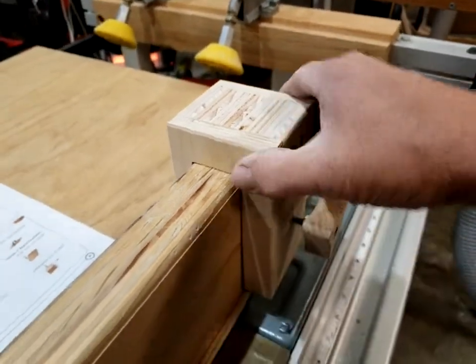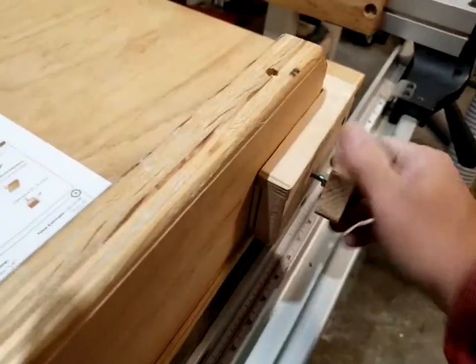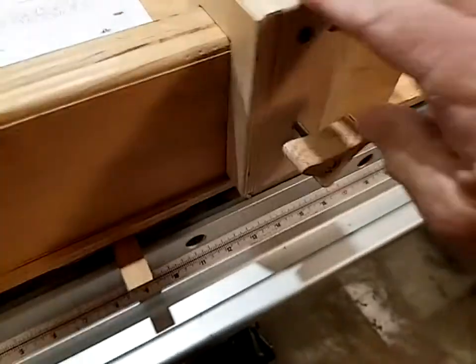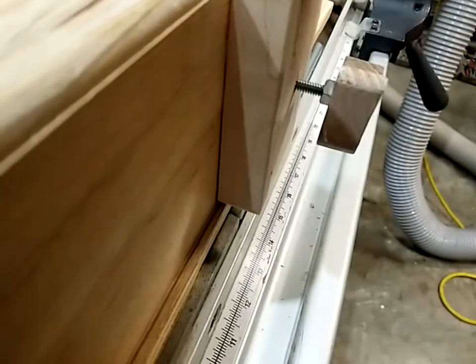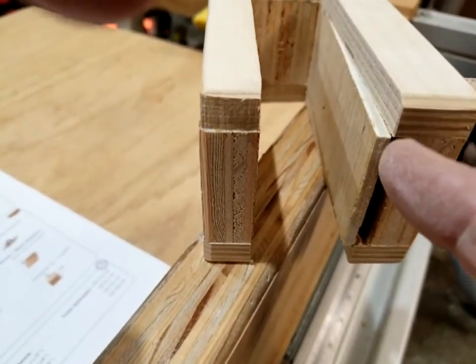You want to put a stop in there — it ain't moving. It fits with the fence and it's flexible enough to work. You can put it anywhere you want. I got this idea off of YouTube. The guy made the plywood blocks but hadn't put the gusset out here — it needs a gusset to reinforce it, otherwise this causes the thing to kick out. This is glued on to the block and all the way across there, but don't glue the quarter-inch board inside. As soon as you crank that out, this thing pushes out — it makes a nice wedge and it really tightens on the fence.